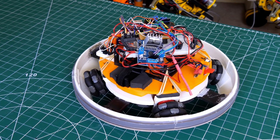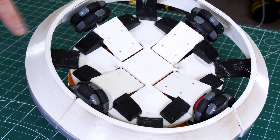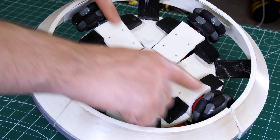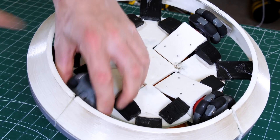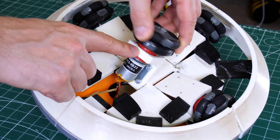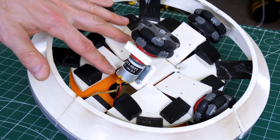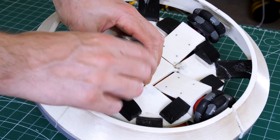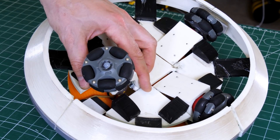Let's have a look inside this less-than-perfect BB-8 head — mostly a massive mess of wires. Starting with the wheels: we've got four omnidirectional wheels with little wheels all around the outside, meaning this pair of wheels can drive one way and the others slide, allowing us to control two axes at the same time to balance on the ball. The motors aren't really ideal — they do have gear heads but there are no wheel encoders, so there's no way of accurately positioning the motor or controlling its speed. The wheel is also a bit loose, apparently attached with hot glue due to a wrong shaft diameter.